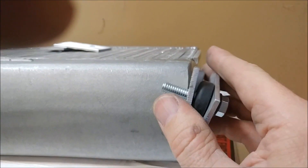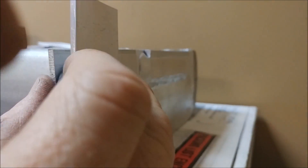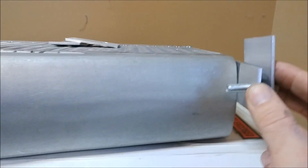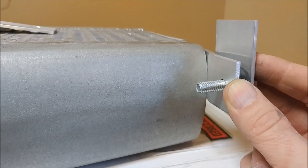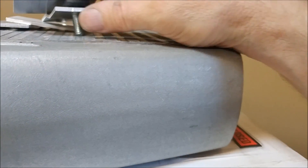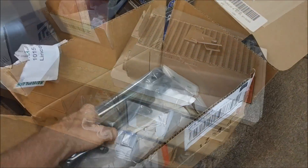The intercooler is upside down right now — we flipped it over. These are the rear brackets: one part will be welded on to the intercooler and the other part welded onto the radiator, using a rubber grommet to provide a little shock cushioning between the two systems — not for any particular reason, just to pad things out and get the right dimensions. I'll be using shorter bolts with locking nuts. Anyway, that needs a bit more welding, so I'm getting some stuff together for Brett.